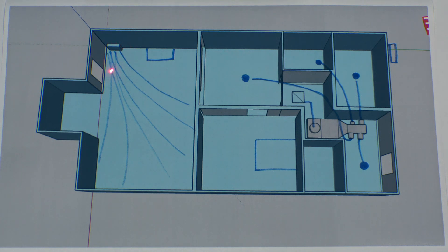We really liked how the low floor unit blended in well with the room — it's hidden next to the couch and the air blows in the right direction. One of the biggest things we had to think about is where the client will spend most of their time — typically the couch. We've got adjustable louvers on this system so we're not going to have direct cold air blowing on the body, which is something we always want to avoid with ductless in cooling mode. If cold air blows right on you, you'll feel like you're in a freezer pretty quickly.